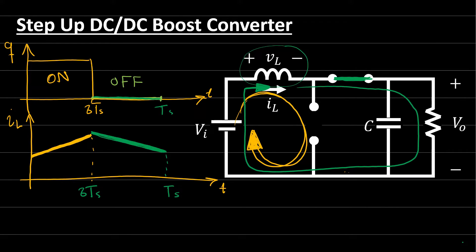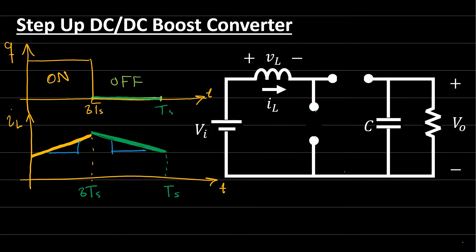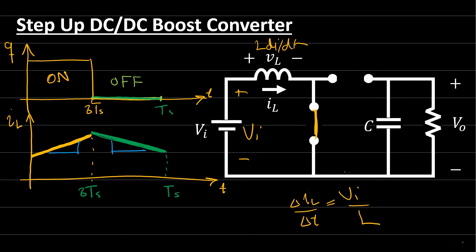Now let's find the relation between output and input voltage. We must have balanced operation in any DC-to-DC converter; otherwise, energy accumulates in the storage device and the converter loses balance. When the switch is conducting, the voltage across the inductor is L·di/dt = V_in, so the slope of the inductor current is V_in / L.